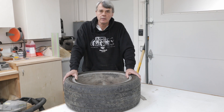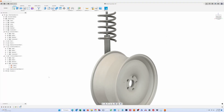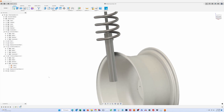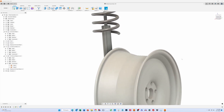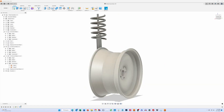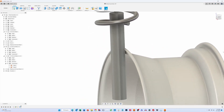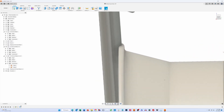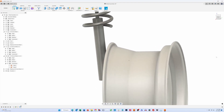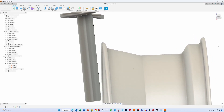So how do we deal with this when putting wheels on our car? Let's go back to the 8-inch wide wheel and assume it is mounted on a car with a McPherson strut suspension. The damper in the car would be placed right next to the wheel and might look something like this. Notice how close the wheel is to the damper body — this is very typical. Now let's remove the 8-inch wheel and install the 10-inch wheel that has the same offset. You can see we have a problem and this wheel would clearly not fit. Now let's install the wider wheel that has the same backspacing. That's better — we've solved our problem with the damper, but have we created any other problems?